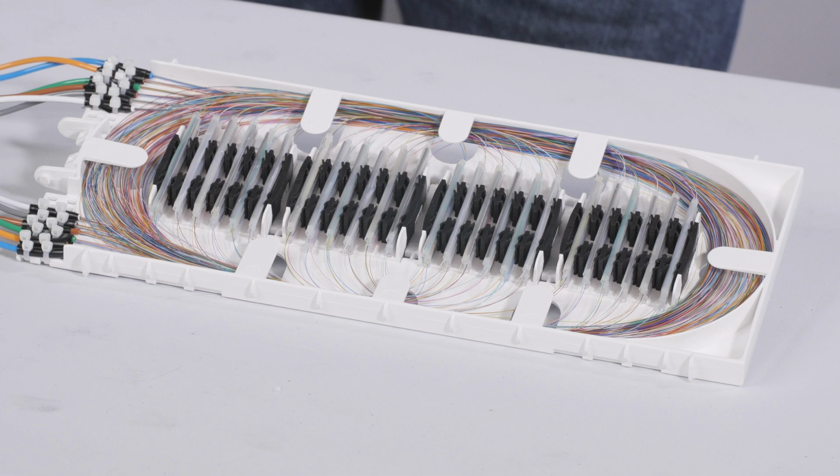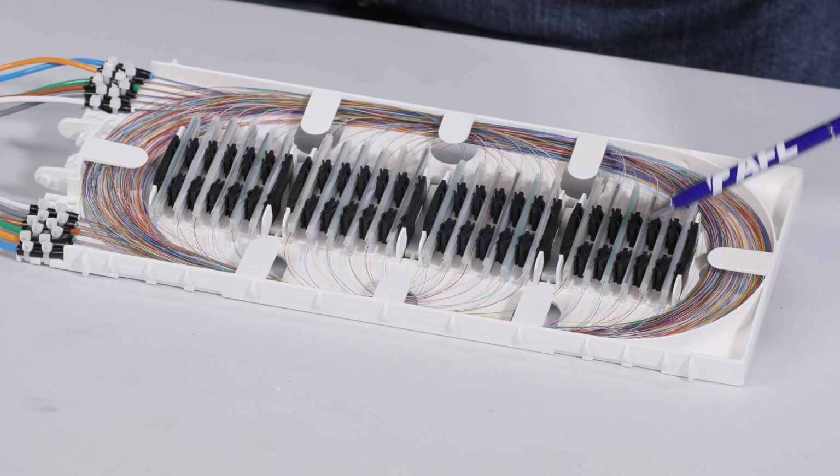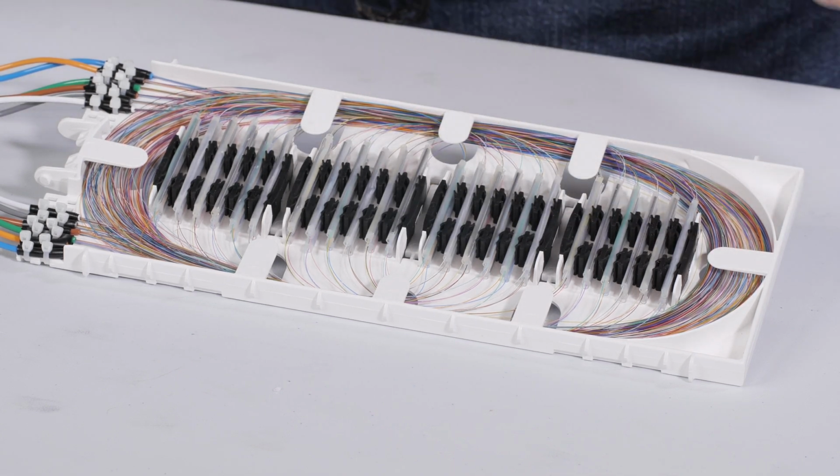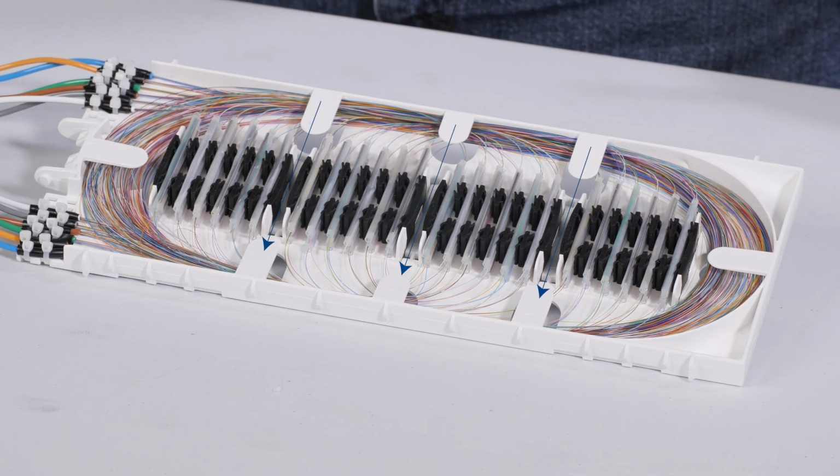When splicing loose tube or single fiber fusion in Apex, secure the tubes at the splice tray with supplied tie wraps using 2 per tube. It is recommended to use a few wraps of electrical tape at the end of the tube to increase pull-out strength. It is critical that none of the tubes extend into the fiber pathway of the splice tray. When planning the splice in the tray, leave enough slack to splice from both ends to prevent bend radius violations. Pathways between the splice modules may be used if desired.